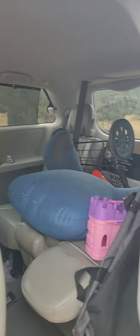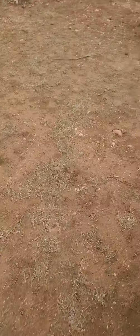One more thing to work on, guys — it's alright, we'll get it fixed. Anyway, so three points of contact: a roller there, there's one in the back you can see it, and there's one on top right here. All I did was take some blue rags, went through and cleaned it up really good along this railing and on the inside railing. Then used some WD-40 to clean it out, wiped off the WD-40 as much as I could, and then I took a little jelly — put a little tiny bit on the roller. You can see a little bit right there.